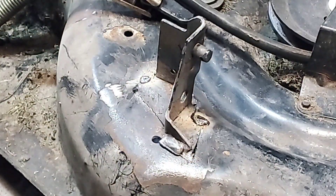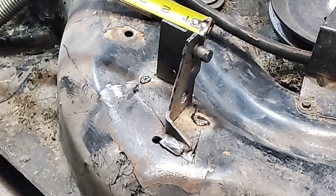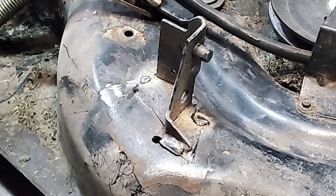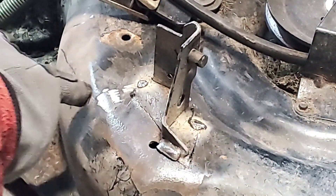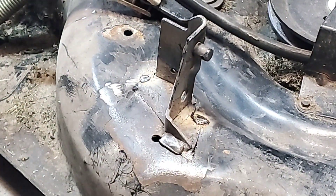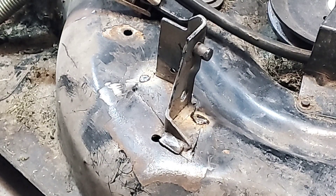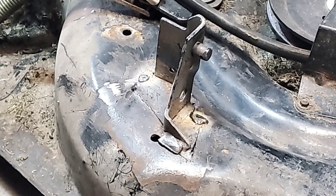So we've got that tacked in place. I checked my measurements again — I just double-checked with the customer and it's actually 15 and a half inches that we have for room, so we're good there. Everything is still fine around it. I'm just going to drill out this corner here — I just don't want that crack spreading anymore. And I do have a fire extinguisher off in the corner just in case this thing decides to go up. So always be safe, protect yourself and the ones around you.